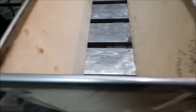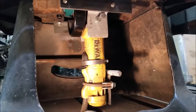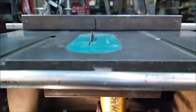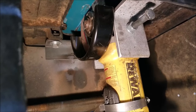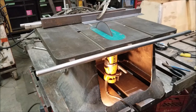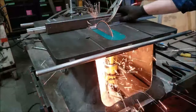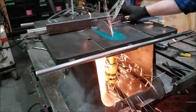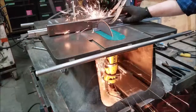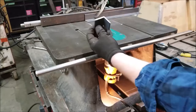This video is getting pretty long. I'm gonna have a follow-up video where I show how I did the miters for the bottom of the light — I'm gonna use the tilt 45 mechanism for that — and I'll show you what the light looks like after it's installed. I think there's many things I could make for this: I need a fixed 90-degree sled and then right and left fixed 45-degree sleds so you can just throw it on top, and then I'd use this one for doing compound angles. Normally I would put a piece of angle like this in my horizontal bandsaw, but not everybody has one — I just wanted to show what its possibilities are. This is a two-inch piece of angle and it cuts it just as easy as an abrasive chop saw. Hit that subscribe button so you don't miss my follow-up video. Thanks for watching, and remember: it's not stupid if it works.